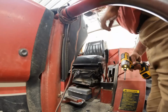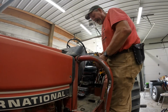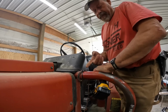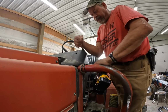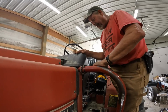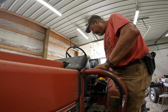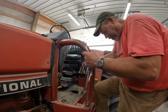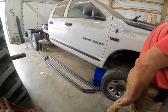The torque amplifier lever started feeling kind of wonky when we finished baling. Moves up and down, doesn't do anything. And come to find out there's a, well, I guess it's a cable with a piece threaded in the end that's bent that goes through the lever and it's broke off. So we have the part, so this afternoon is dedicated to dismantling whatever is necessary to fix that, because we kind of like a torque. It's kind of handy. You can slow down and speed up under power.